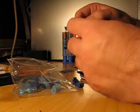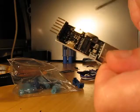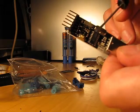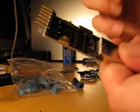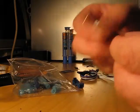So what do we have here? A 3.3V switch, 5V switch. This is the main interface chip CH340G — it is an alternative to FTDI. It works and it is cheap. FTDIs are relatively expensive, a few bucks. And this whole thing costs, I think, around 1 US dollar including shipping.